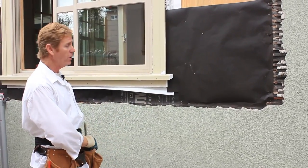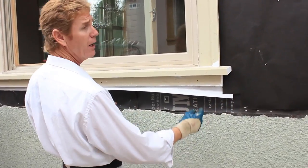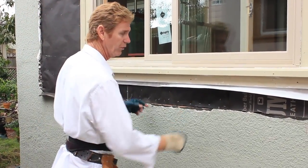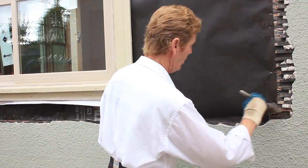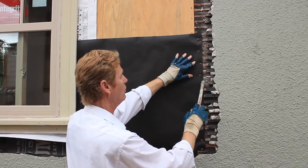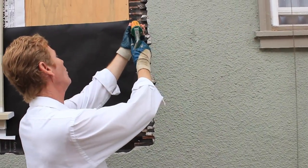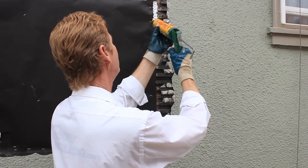I'll show you with a window I already did. I just did a spot over there and now, of course, you have to cover the entire thing, otherwise water will go in those little holes. I spent about 15 minutes right here just brushing these keys out, and the contractor actually got rid of the keys here. Why did he do that? Because he thought, if you get rid of the keys, isn't it easier to caulk? Yes and no. What we want to do is seal this tar paper to the wood lath itself.